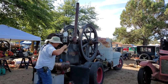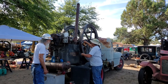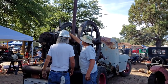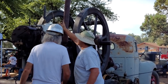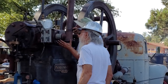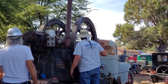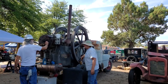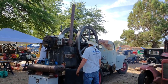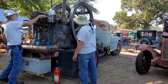Here we're oiling the igniter and the intake valve, checking everything one last time. There's a primer cup on the fuel system on my side — I prime it with three cups of gasoline. The little cup holds a little more than a thimble full of gas, and I fill it three times, letting it run down the pipe so that when I turn on the air, it blows an air-fuel mixture into the cylinder for starting. With a primer cup it starts on the first try. Then checking the exact position of the piston and flywheels, walking around, making sure the igniter is set, and closing the ignition switch.